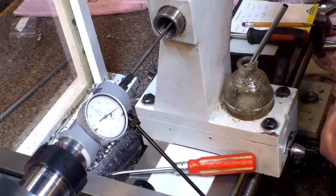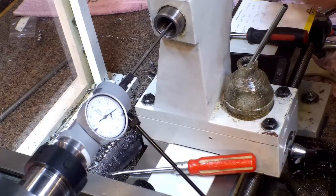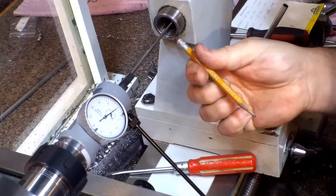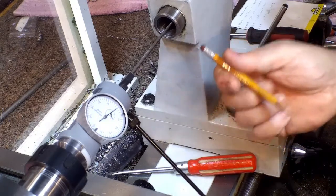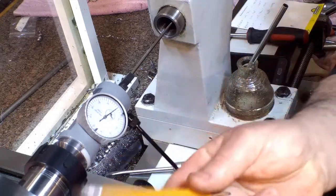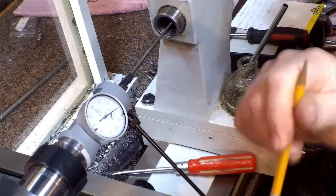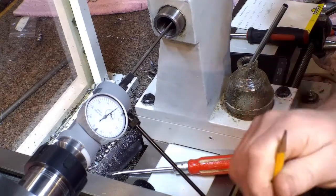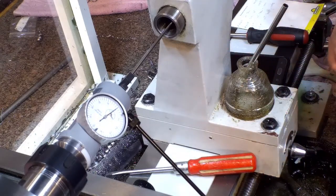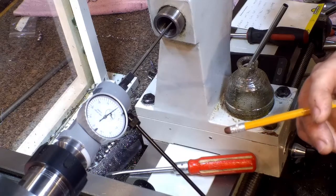This morning I had it all apart, cleaned it, lubed it, and started from scratch. First I tested it before I took it apart — I tested with my chuck into just the internal of the tailstock taper, then I put in a live center and a dead center, then I took off the chuck and put an ER32 collet holder in with the drawbar.